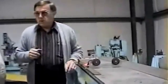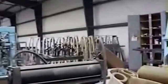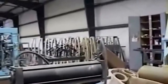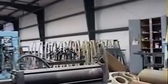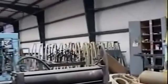Why? Because in the bond fixture for the wing, there's only room inside of the rib cutouts to put the bend this way, not this way. So you have to find the high spot and mark it. Well, it's marked by serial number. We put a serial number at a certain location, which is shown on the drawing. Then the bond operator knows where to put the spar. See, all of this you got to know. So you got to send your people over there and learn this in Hot Springs. I can help them.